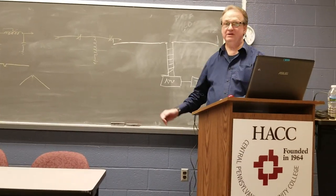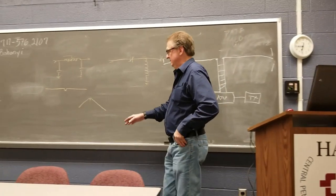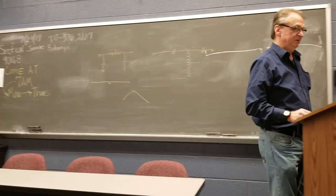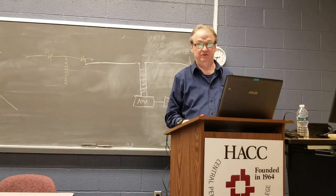Anything after this is an antenna you actually need a tuner for. I have mine at a 45 degree angle, so I get the 50 ohms. I have a multiband dipole. The only time I would need a tuner is if I want to work 15, and I don't care about 15 meters at this point.